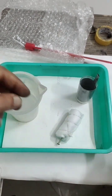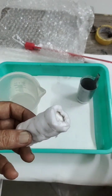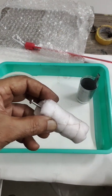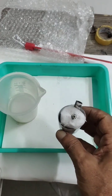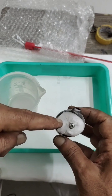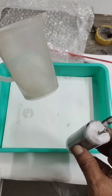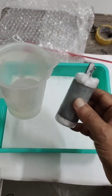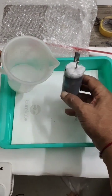I coated this rod and then wrapped it with a polyester frame like this, then slowly made it into shape — the final touch. After doing this I am going to insert it. Previously I was putting powder in a polyester bag and wetting it. This time I have done it differently — I am going to fill it and wet it properly with electrolyte. The electrolyte is zinc sulfate, a trace of zinc chloride, and manganese sulfate.